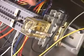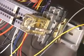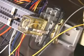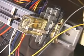A good installation is not complete without all safety devices connected and in operation. An important safety device for the Humidaire unit is the fan interlock relay. This relay is located on the remote temperature control unit, adjacent to the electrical connection terminals. On gas-fired Humidaire units in the United States, we normally supply a relay with a 120-volt coil. A 220-volt coil is supplied for other countries.